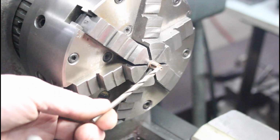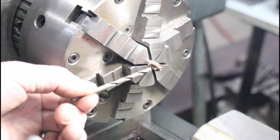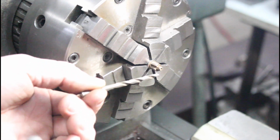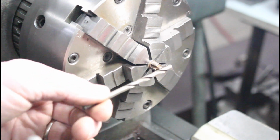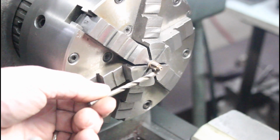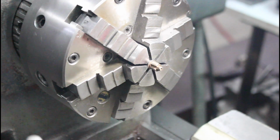All we're doing here is holding that nut on, and most of the pressure of that handle is going to be taken up by this retaining pin in here. It shouldn't really ever be pulling out on much. So with the press fit inside of this shaft, and I might Loctite it too, holding that little nut on I think is not going to be a big deal. So I might go a little bit smaller than this, but first thing I'll do is face this off right up to our shaft portion here where the handle fits over, and then I'll center drill it. I'll take a look at my drill bits and see what I'm going to do.